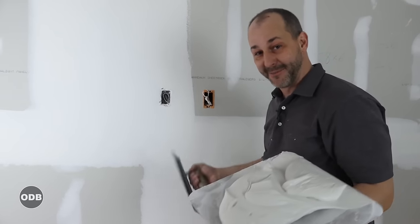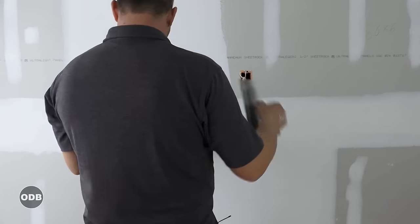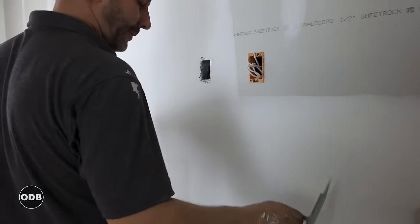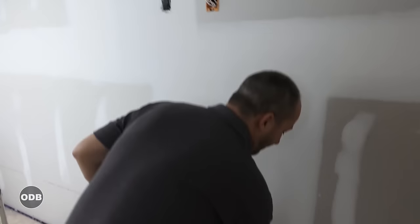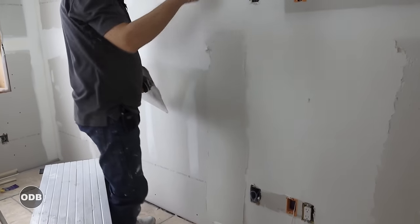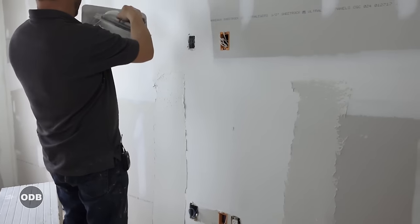It's still going to be there, it's still going to be a bump — you just won't be able to see it. So here's how we do it: we started off by putting mud down the middle, getting our little ridges, then took off the ridges and stretched it out. Now we're going to stretch it out one more time — over here and over here — that's how wide we're going to make our joint.